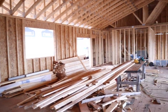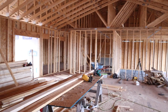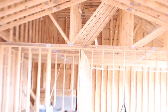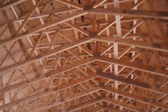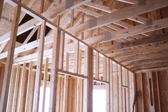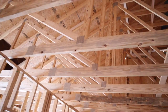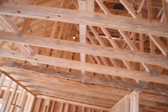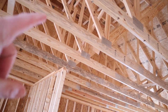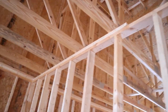That one, that one, and back here in the gym area there's some windows back there that need cut out. I'm not going to cut that one out yet until I put that plywood up there in the attic space. I have some spacing already done — these are two foot on center. Right here, this wall needs double plated. Then I'll space out the bottom of these trusses two foot on center and run the boards straight across from truss to truss that helps brace them after I do the spacing. You don't want to do a ton of bracing up here first before you space these out, because it could be harder to get these two foot on center where they belong.